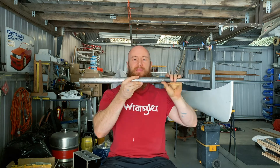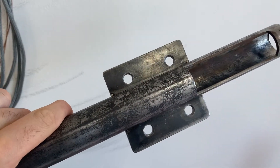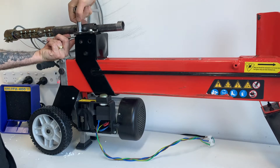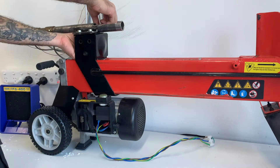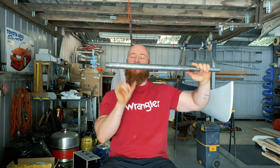From a fabrication point of view, the unit requires an injection barrel as per the precious plastic specs, so that's a 25 nominal bore plumbing pipe. We simply weld on two tabs. The position of the tabs determines the stroke length, so it's critical that you orientate the barrel relative to the stroke length of the machine. You want it to traverse close to the end, push all the way through, but there's still space at the bottom of the barrel.